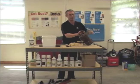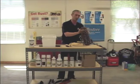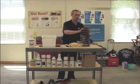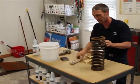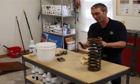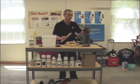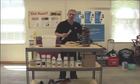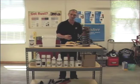As you can see on this end here, this is about a 40, 50-year-old spring, so it's got some really heavy rust and corrosion on it. What you want to do, start with a simple process. Wipe it down, get dirt, debris off of it. Lightly brush it with a wire brush. No need to get incredibly abrasive here. You're not trying to completely remove the rust, just get the large scale and dirt off so it'll allow this to penetrate to the substrate and completely dissolve what's there.